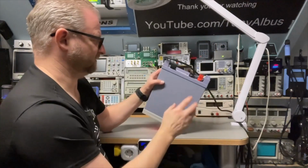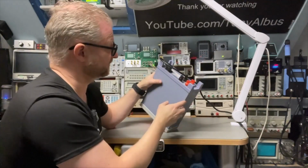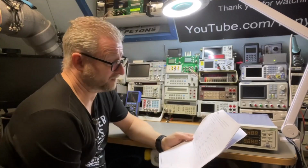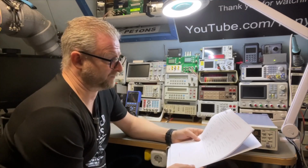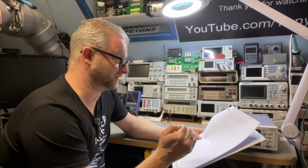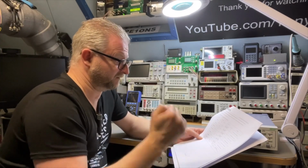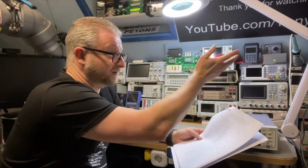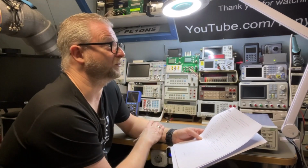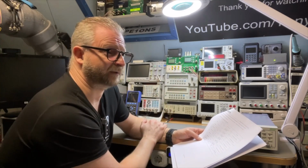And well, I just need to connect them, but mostly I can probably just change the wires from that big meter there. Well, I'm pointing all the time, but you don't see, of course. The alarm options seem nice, because you can set an alarm for a maximum current, but you can also set an alarm on the lower current. You can do the same for the power upper limit, power lower limit. So I can set my limit at 10 amps. If I start using more than 10 amps here, I have a problem. And maybe I can even set the alarm to 1,000 watts. Yeah, that is around 4 or 5 amps.